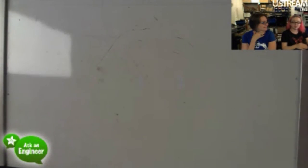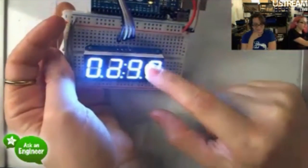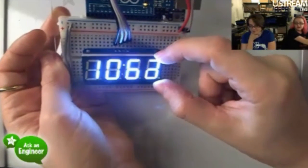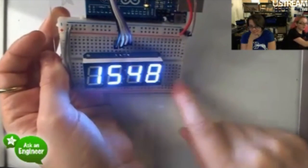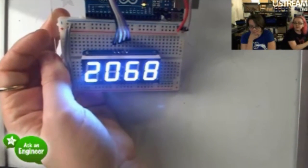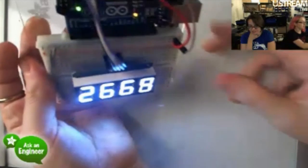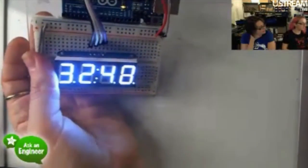They're gorgeous. They're a little expensive, but definitely worth it. This is super bright — I'm running a simple test here. I have it on the I2C backpack because there are just too many pins to wire it otherwise. It's got full seven-segment digits, 0.56 inches high, a colon in the middle for time displays, and four decimal dots. The LEDs are really even running at constant current — a really nice, crisp white. Not too cool, not too warm.